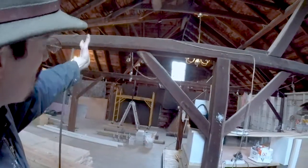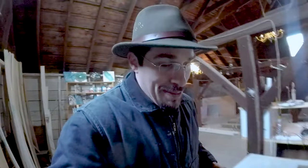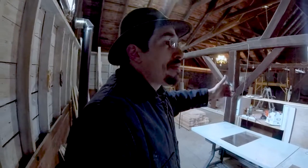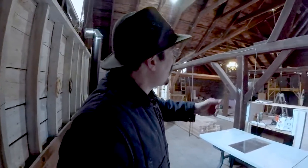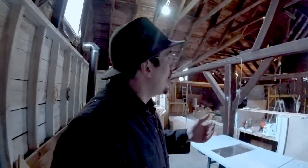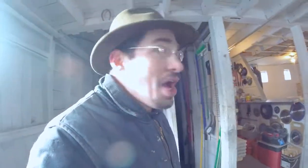The process of drawing in the walls and pushing up on that rafter is going to be a long game. After 135 years, we've got to do what amounts to probably a crank a month on the turnbuckle and a twist on the lolly column — slowly bringing it back. You don't want to do it all at once. You basically do it until you hear a little groan, then let it settle. This will take about a year to get it shifted back, at which point we'll reinforce that rafter and it should be good for another 130 years or so.